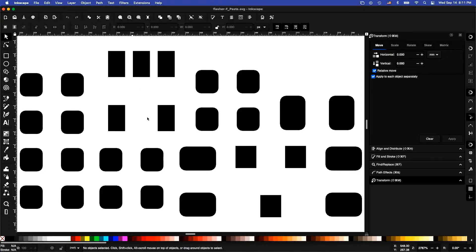If we zoom in, you can see these are all sort of filled-in rectangles or rounded rectangles for the pads. Some tutorials online will suggest that you should ungroup everything and shrink these pads by something like 80% about their centers as individual objects, but that turns out not to be quite the right thing to do. You really want to offset each of these outlines by half the width of the laser beam, to account for the kerf of the beam, so that when the beam cuts the stencil you get back to the size of the pads. By trial and error, I figured out that's about 75 microns for the K40 laser.